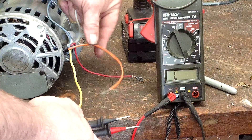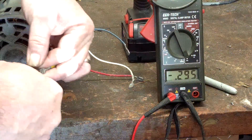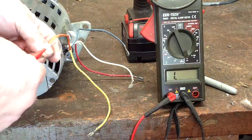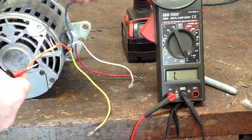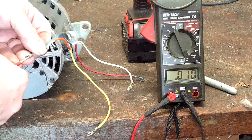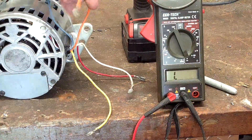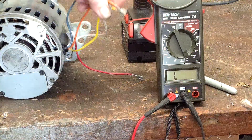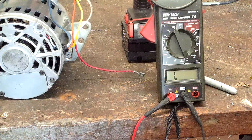We're going to isolate T3 and T4. We also have continuity there. As a check to see if there's any continuity between the two windings, we'll test to one of the other two legs — T3 here — and unfortunately we have a bad motor. What's going on is both of the main windings have shorted together internally inside of this motor. This particular motor would either need to be rewound or replaced; given the cheap nature of this motor, it would be replaced.